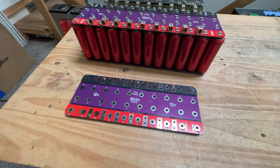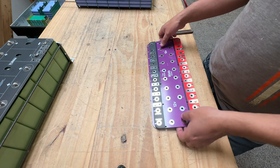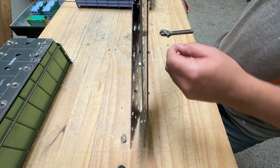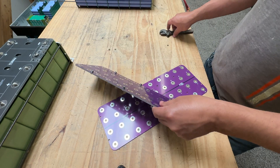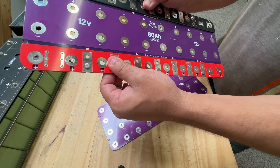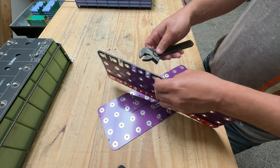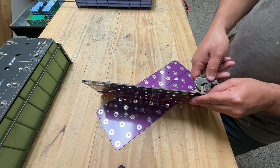So we're going to cut this one right here and make that battery. The cool thing about DIY is you can make whatever you need — custom size. I'm going to show you how to do it right now. This is the 80 amp hour kit. This one doesn't have the two AWG blocks for terminals. These screws are here just to hold it — it's a double layer so it can transfer power better at the edges on both the positive and negative side. We start by taking these bolts out.